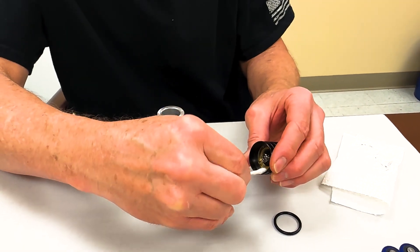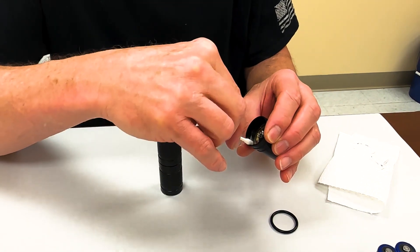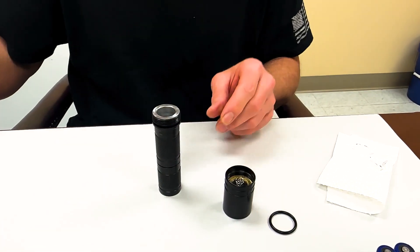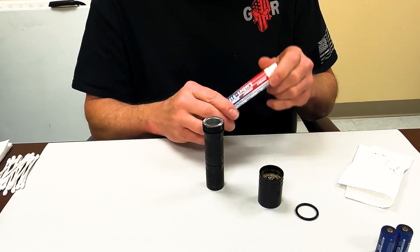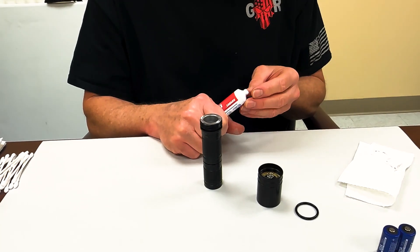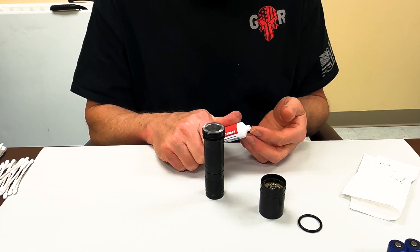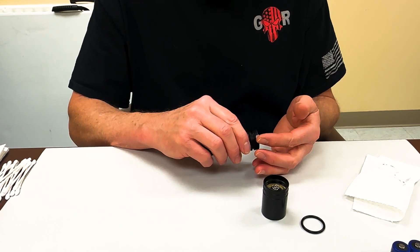If you do this once a month or so it's really easy, no big deal. But if you wait and do it once a year, you'll have some real gunk in there. Then take your lube — this is what we use. There are lots of good lubes, but this lube is specifically made for o-rings and threaded fittings. Lubr-Film is a sanitary lubricant, meaning it's not poisonous — it's used on food preparation equipment.